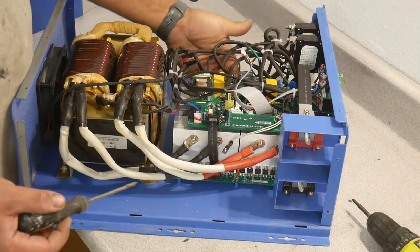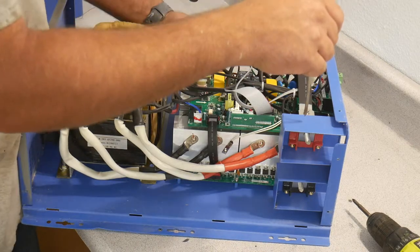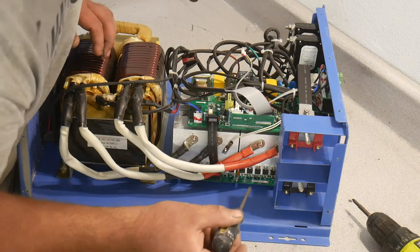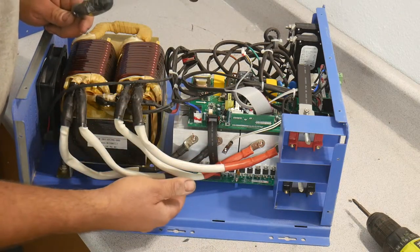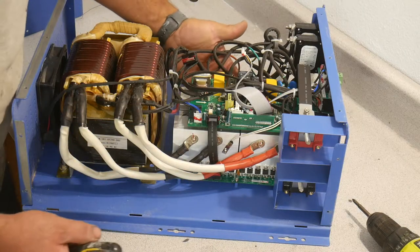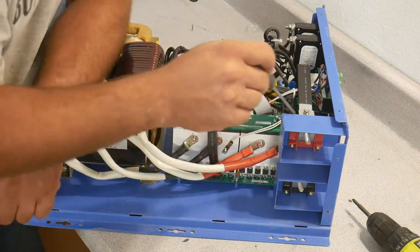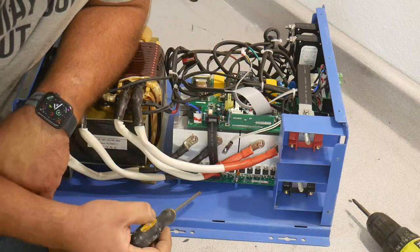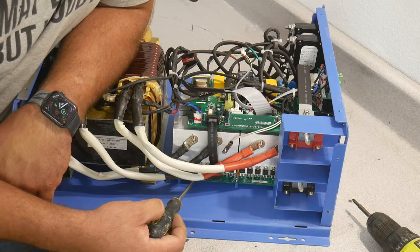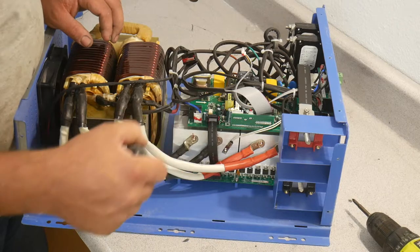Now, the heat sink on this side is tied to the negative DC end, okay? Now these, how many did I say there were? 2, 4, 6, 8. These 8 MOSFETs output is connected to these 8 MOSFET outputs, and these to these, okay? There's a positive bus that comes from the battery that feeds into the bottom source of these switches. Okay, so you've got the output that goes to the transformer.